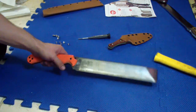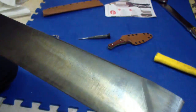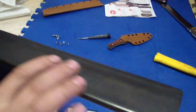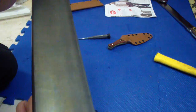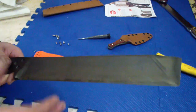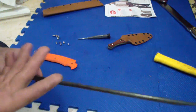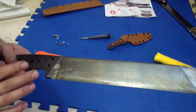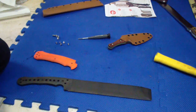That's the only reason I keep the acid bath finish. It's actually pretty cool — at certain angles the acid wash glances blue, so it has a very funky color. Not blue-blue, but you get little hints of bluish color at certain light angles — it's almost like a bluing. I think it may be something very similar to what gun bluing actually is. So I hope you enjoyed it, guys. Very simple, very easy — look for PCB acid, mix it with water, get a plastic or glass container — cannot be metal, since anything metal will get eaten away. It has to be PVC or glass. Thanks for watching, take care, stay safe, and don't cut yourself.